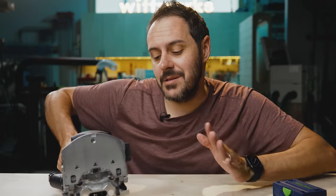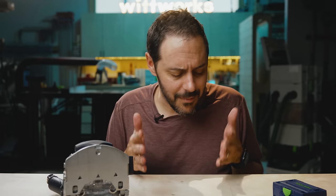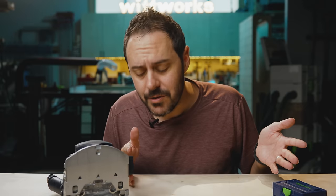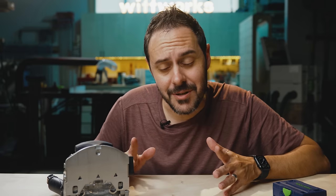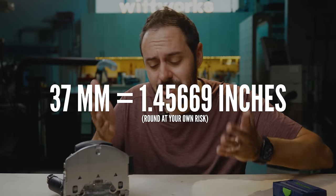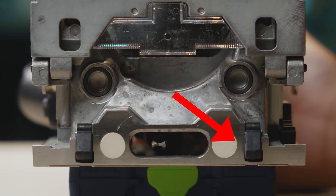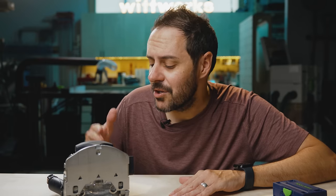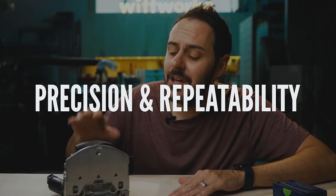When I've joined boards together using other methods, I always end up measuring about an inch and a half to two inches from the end of the material for my first biscuit or whatever I'm using. With this feature, you no longer need to measure, because 37 millimeters is roughly an inch and a half. You can get started on your project right away without marking or measuring — just by referencing this tab on either end. That's where the Domino really begins to shine: precision and repeatability, very fast.